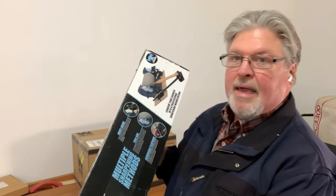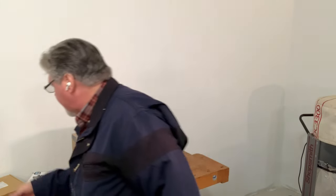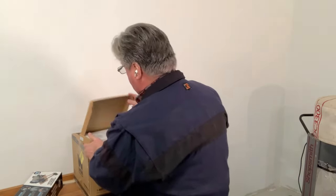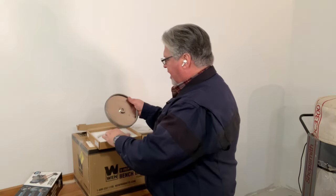Now the last couple items go together. I bought myself a variable speed 8-inch grinder, a grinding tool. This is for sharpening turning tools primarily, and a CBN wheel. These are wheels made of an abrasive, kind of think of almost like a carbide or a diamond embedded wheel. And this is designed to last forever, never losing its shape, never having to be replaced as long as I don't damage it. You may have heard Stumpy Nubs talking about these and raving about these.